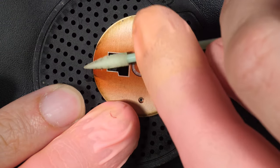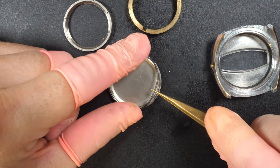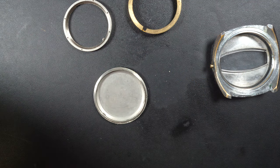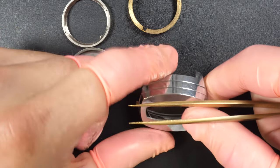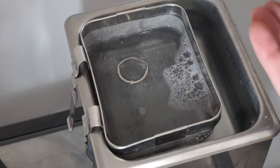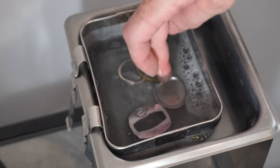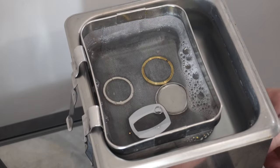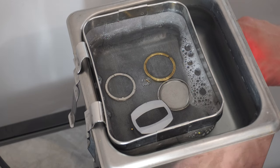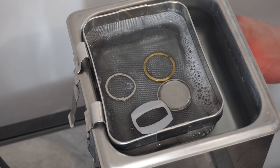Just doing a very light clean of the dial with some product, very gently. Now focusing on the case parts — look at the O-ring and seal, it is so dried up, so I'm going to change it obviously. Same on the crystal — there is a seal there that is fully dry. I'm going to put all the case parts in the ultrasonic machine. I also have a discount for you if you want to use this ultrasonic machine — it's a very good one for watchmaking as a hobby or professionally. You can find the link with a five percent discount in the description below.